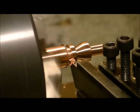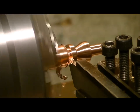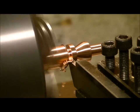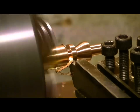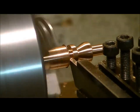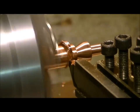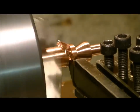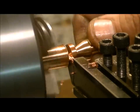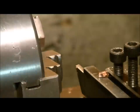Let's see if we can bring this up to 350 RPM. Now when you're parting copper you've got to take it really super slow — same with pretty much any metal, though brass can be quicker. Cutting fluid does help a lot. Okay, so we've cut that off. I'll let that cool for a minute and then we'll come right back.